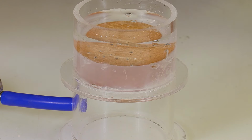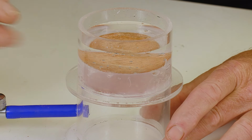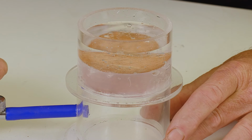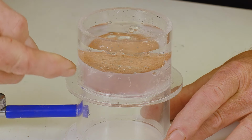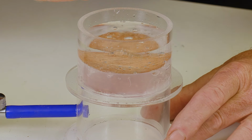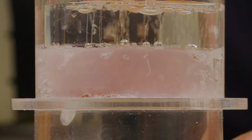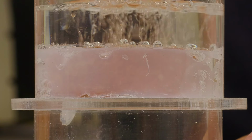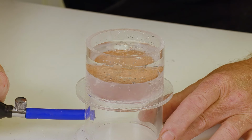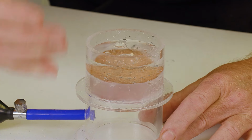water penetrates that brick. So if I now apply this little bellows and pump this up, it will put air into the bottom there. Now, we don't want a great deal of air, we just want to gently put some air in there. And you can see straight away that that air is bubbling through that brickwork, it's bubbling through the Stormdry, and it's letting that air escape. Now, air could be water vapor, it could just be ordinary air, but whatever it is, it proves that anything that's locked inside that brick has the chance to evaporate with the wind and the rain and everything else, and that it's not locking anything at all into that brickwork. We've still got a perfectly porous or breathable surface which repels water but doesn't trap it.